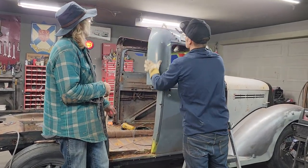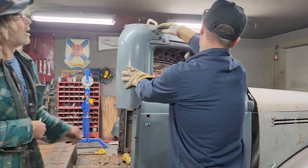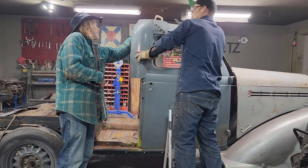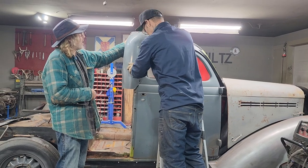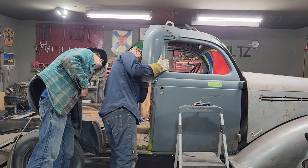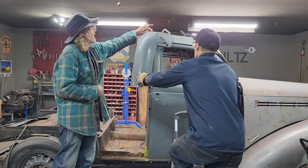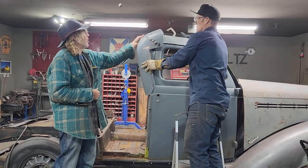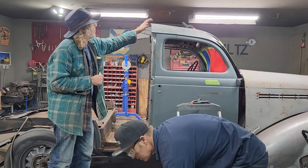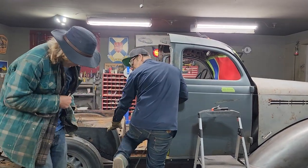I'm probably going to have to. We're not too high, are we? Well, I like to have it lean a little bit, but I have got an issue. Actually, it's hitting hard right here. This corner has to come off. The original roof has to come off because this is turning down that little bit. Yes, I'd say just back a couple inches, because the last 2 inches of this is turning down and you've got the original roof. You have to cut back. I'm going to go for it. You don't need to take the brace out, I'm just going to cut that. Yeah, and that way I'll know how to cut both sides. Watch it, Jimbo.